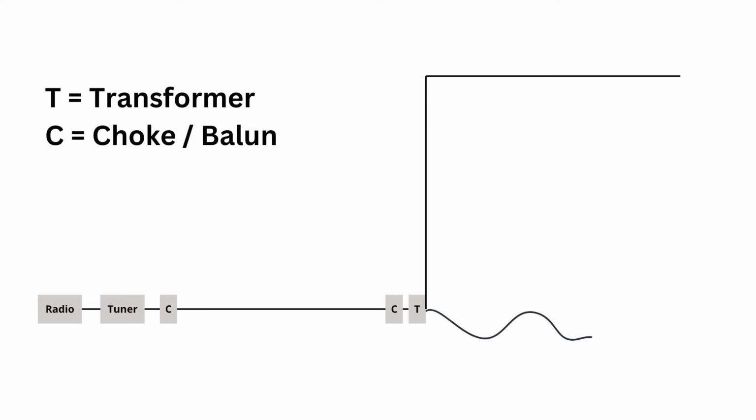And I know that sounds a little bit confusing, but we use alternating current in our antennas, AC current, and it works off of current going one direction on one line and the opposite direction on the other, and it switches back and forth. And when we use something like a counterpoise, it acts like a big capacitor, storing and releasing energy. A lot of folks will tell you, hey, it's fine, bro. Go ahead and use your coaxial cable outer shield as your counterpoise.